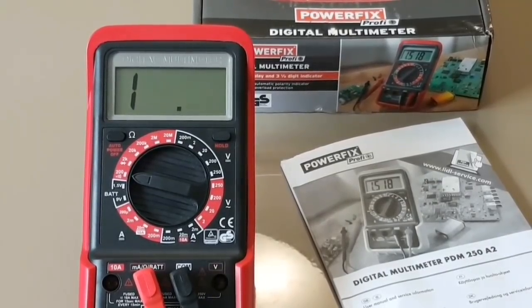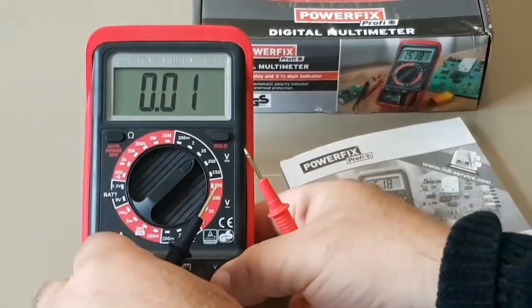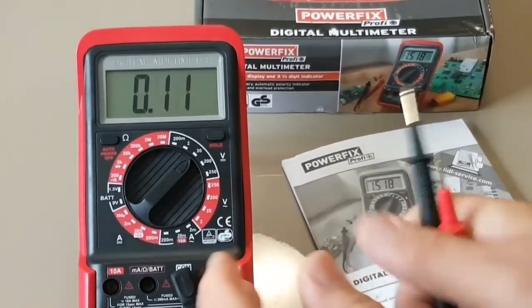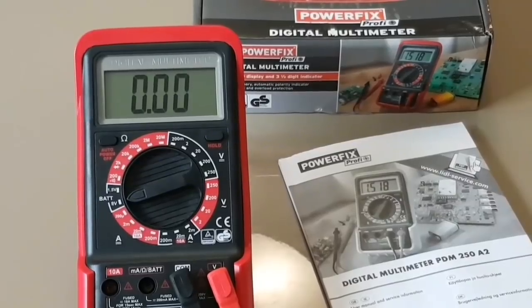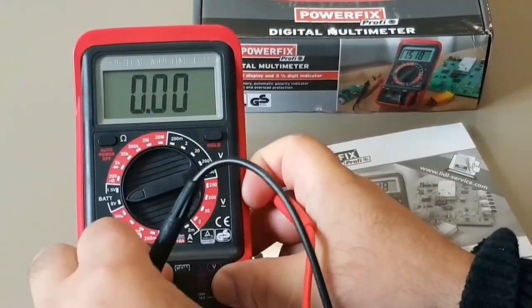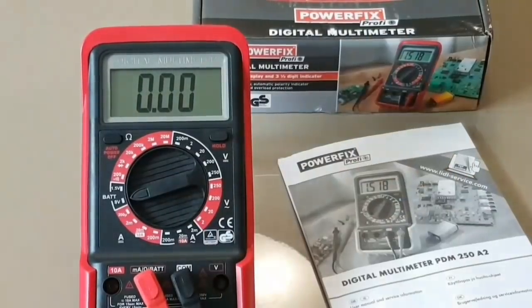I'll do a quick voltage test demonstration. Right now we're in a standard voltage test with a nine-volt Duracell battery — and oops, forgot to change the probes. That's what I meant by annoying. Okay, once again 9.20 volts. Now this being a non-auto-ranging meter, I'll bring it back to the 9-volt selector. What happens when you go to the 9-volt selector: it's proprietary and all it does is put a slight load on the battery. So if you have a battery that's starting to fail or is iffy, by using this it can tell you just how accurate or inaccurate it is. Once again I have to go back on the input selector — you can see how annoying that can be over time. And 9.17, so even with the load this 9-volt battery is perfectly fine. That's a nifty little feature, always great to have.